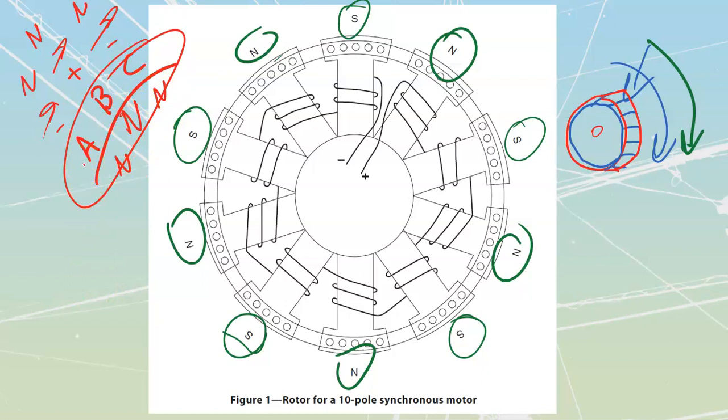We need to carry the DC into the rotor. The best way is via slip rings and brushes. Unlike a commutator — which is a rotating switch — a slip ring is a rotating point of contact that maintains continuous contact. We place the two DC leads onto individual slip rings on the shaft, marked F1 and F2, indicating this is a DC field. The convention is current flowing through from F2 to F1. We push DC in through the slip rings using brushes mounted externally on the machine.